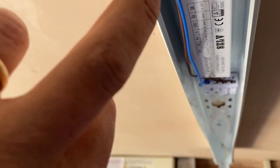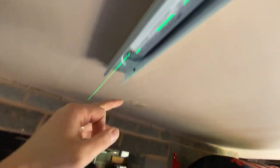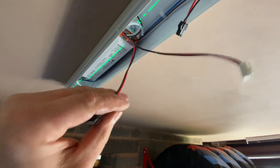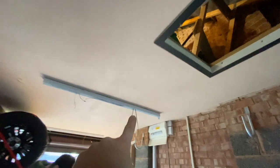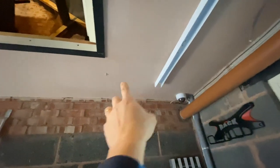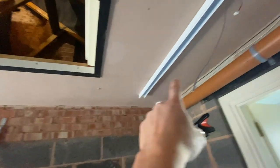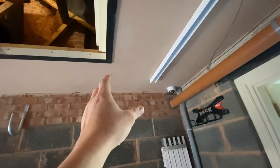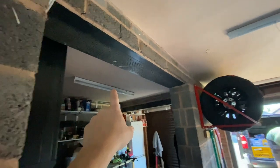These are the same lights - Nite-Bridge - but the difference is we've got a battery backup. We plug that in once we're finished. This is an emergency driver that controls the little lamp, switching over onto battery mode when power is lost, and when power comes back on it switches back and goes back to normal. At the minute we've looped and clipped between the three lights. That'll be our switch line and neutral. We're going to wire a permanent feed up here to here, which will switch the lights but go via the PIR - so the PIR is in line with the switch.